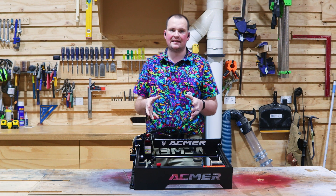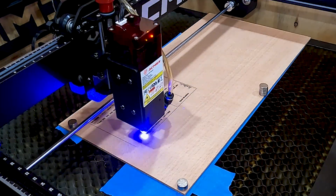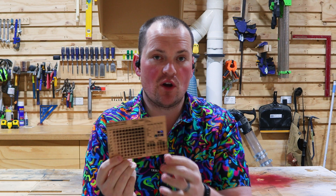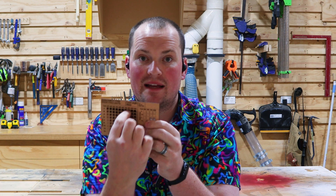When I say test cut, I'm not suggesting you just cut willy-nilly. There is technique with using a laser for the first time. This is a test cut file — basically a file you should always run when trying a new laser or a new bit of material, because it's going to give you all your different speeds and powers, and a good indication of what you want to use. I've got one of these for every laser I've got and every material I use. So when I go to engrave something, for example walnut 3mm ply, I can work through it and say, I want 80% at this speed. Highly suggest you cut one out for every bit of material you're using. Link in the description.